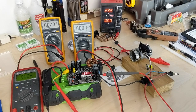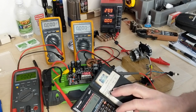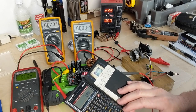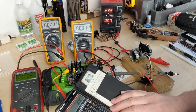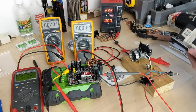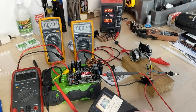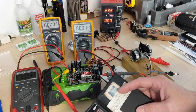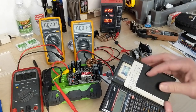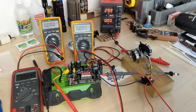Let's do a quick calculation on the actual wattage in versus wattage out to get the efficiency percentage. We have 51 volts times 0.590 amps — around 580 to 590 milliamps off the battery — which is right at 30 watts input. On the output, 1.8 amps at 13.6 volts gives about 24.5 watts output. Dividing that by 30 watts, we're right at 81 to 82 percent efficiency. I was hoping for maybe 85 percent, but 82 percent is still pretty impressive.